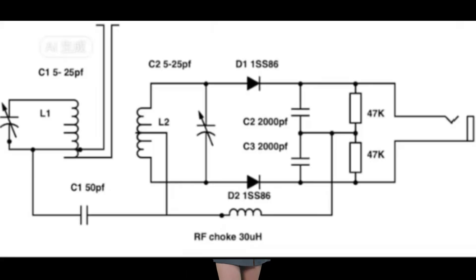This is how slope detection converts the carried signal from FM to AM. However, this method is at best an approximation, not a linear conversion. To reduce the inherent defects of this method, the components in use must have a high Q factor. That's why variable capacitors and coils used in FM Crystal radios must have reasonably high Q factors; otherwise the approximation will get worse, resulting in noisy output. There are several other better FM detection methods such as phase detection or frequency discrimination that have much less noise and have been proven to work in a crystal radio, but these are harder to make. See the YouTube description for more information.